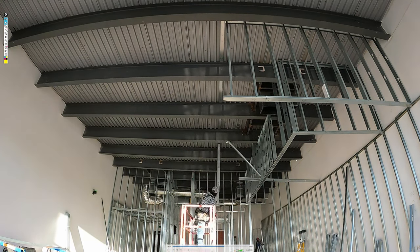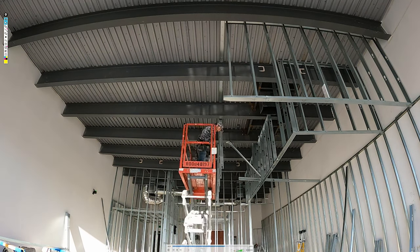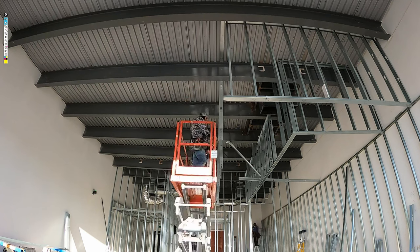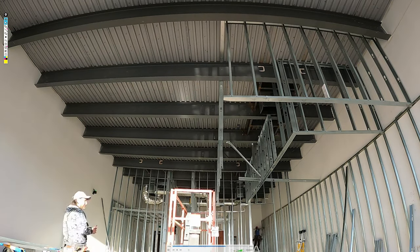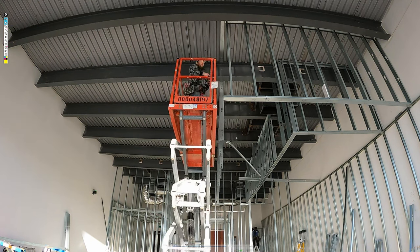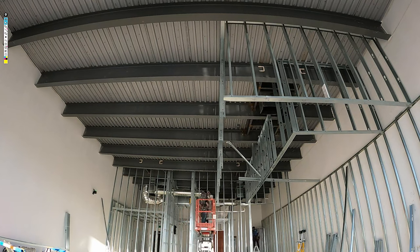And then you'll see once I got the ceiling part in, it's so strong, like you can't go wrong, right? But yeah, go along, hang some studs, and then this way you can also check to make sure the green line isn't hitting any of them, right? And just set it, like I was saying, just cut them a half inch shorter than the elevation, and you're laughing, okay? But yeah, so then I'm going to go back and I'm tying into the end where it's already tied into the clip. It's not going to come out, move anywhere.